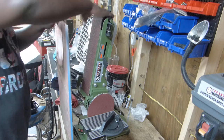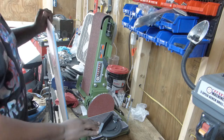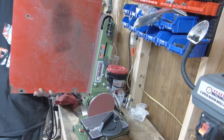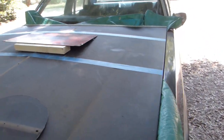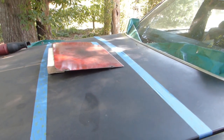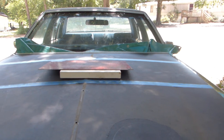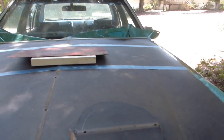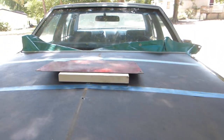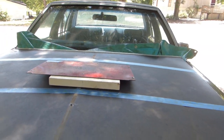Alright guys, I was able to get it cut, so now I'm taking it over to the belt sander. It's pretty close but I want to get it a little bit better — I'm itching to test this thing out, so let's fire it up and see what she does. So far I like the height of it; I didn't want it too obnoxiously tall. The hood has a center line there, so I'll find the center line of this piece of metal as well so I can put a bend directly in the middle. That way it'll sit level on the back piece. Once I do that I can tack it in place, leave the piece of wood there, and start with cardboard pieces to make a template, then get to cutting and welding.